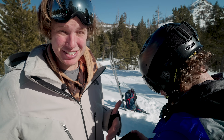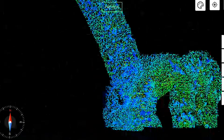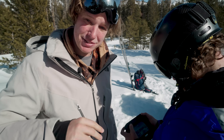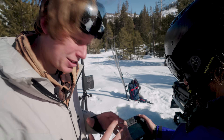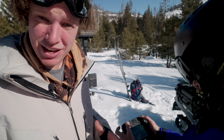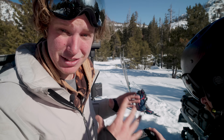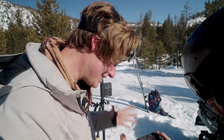That global view is probably the mode I'd use most of the time — just knowing if I'm missing any gaps, where I need to come back and fill in a void. It's not the full LiDAR data though; it's a down-sample. So while it's doing 240,000 points every second, what we're getting on the controller is probably a tenth of that. We're also interested to see how this works for search and rescue applications — can we use this to capture snow drift and potential avalanches, and navigate the hills and slopes to avoid avalanches ourselves?